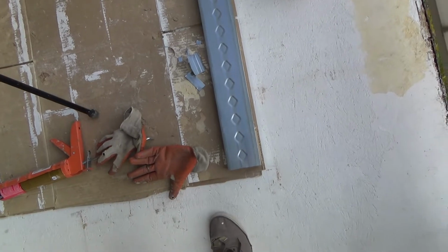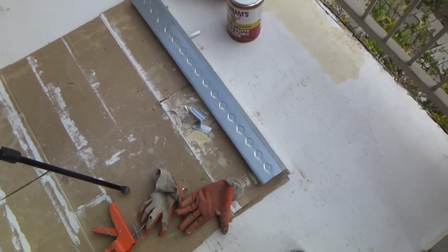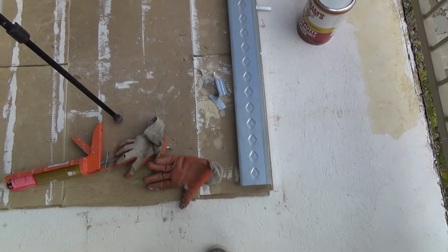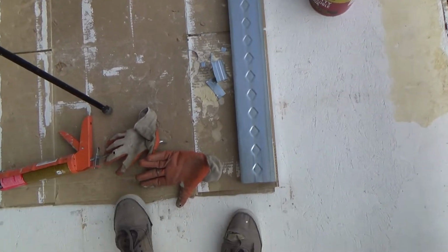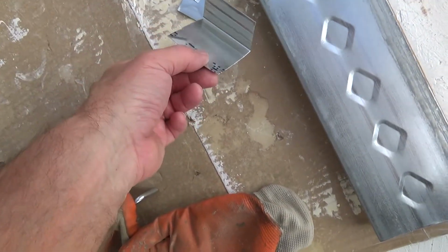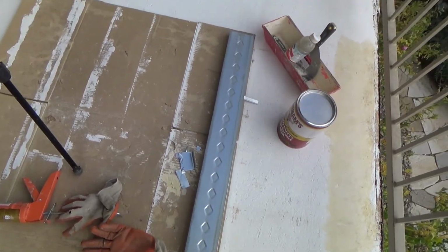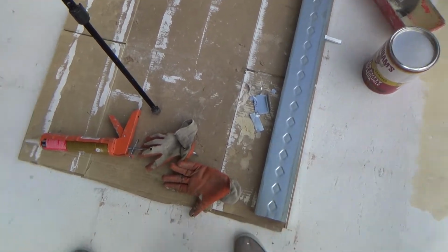And you know, most of the time you have to go to a commercial wholesale house that sells sheetrock, and then they usually sell metal studs, and they sell all kinds of different size, different gauge metal studs and all that kind of stuff. But 25 gauge, non-structural, and it's easy to cut with your tin snips, and you can do all kinds of stuff with it. So think about it next time you're ready for a project, or even before a project.